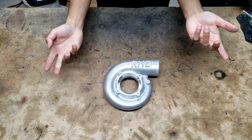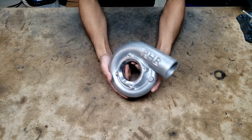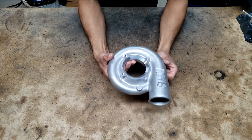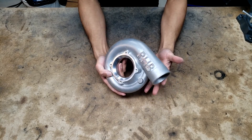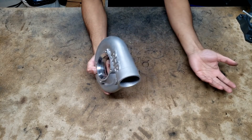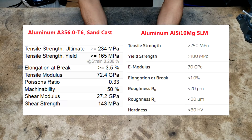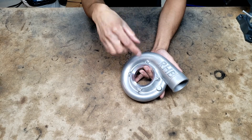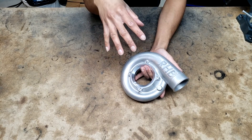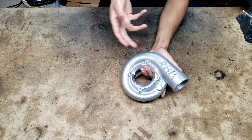This one doesn't actually have a shaft speed sensor because of what I'm running it on, but in the final cast part I'll end up having one. Material integrity seems really good based on the print resolution and the material properties of AlSi10Mg, which is the standard grade 3D printed aluminum. It actually has higher tensile strength than A356 even when A356 is heat treated.